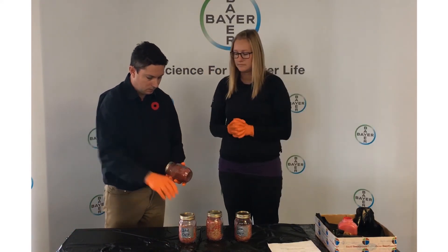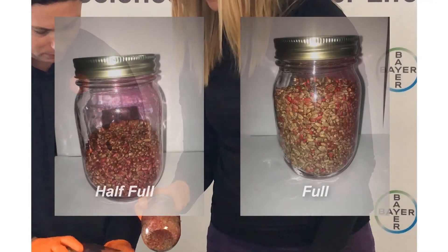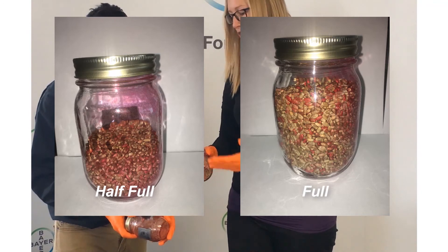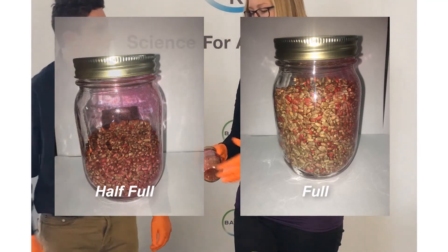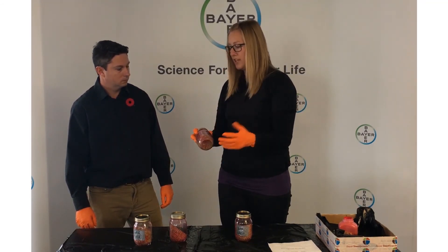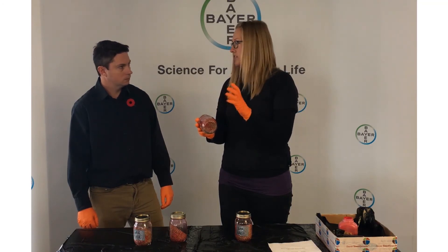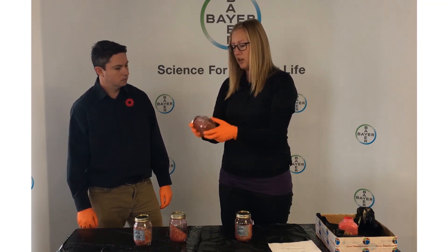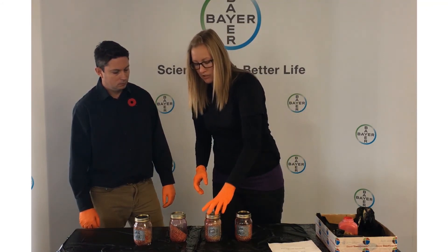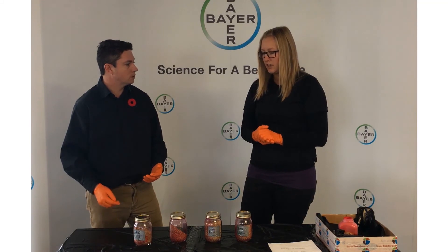Now if we look at the half-full one versus the very full one, there's quite a difference there in the mixing. The half-full one actually looks fairly well mixed. Obviously you're not getting the volume, but the full one — it's like a drip-treater, it's almost your worst-case scenario. Once you get to a pressurized system, we'd see a lot better coverage in all these cases, but we'd still see these differentiations based on cold seed, warm seed, and how full you're running your auger. When you run your auger too full, there's just not enough room between your flighting to allow mixing and that seed-to-seed contact. The bottom seed can't come in contact with the top seed, no matter which way you shake it, in the amount of time it takes to go up the auger. The advice is to just turn it down just a little bit to allow ultimate mixing in your auger to get the most out of your seed treatment.